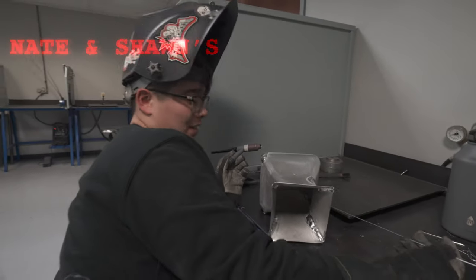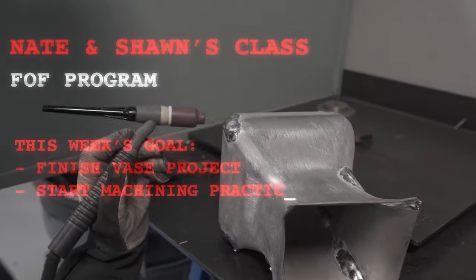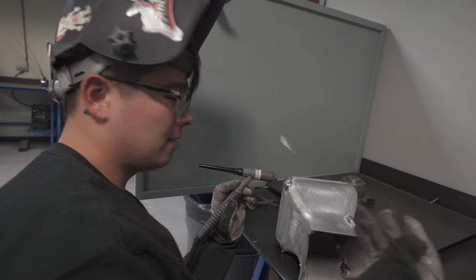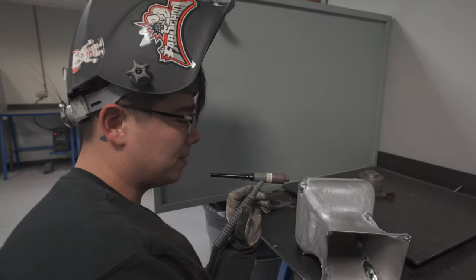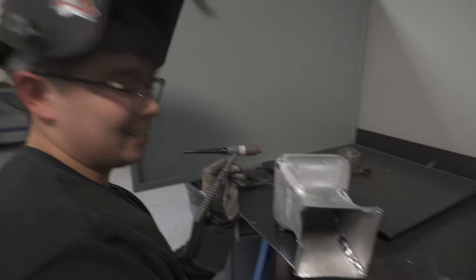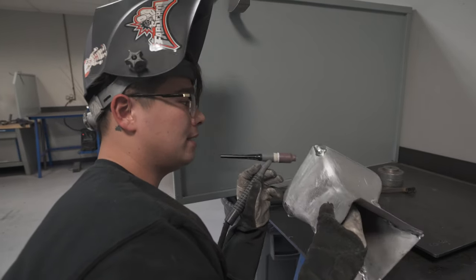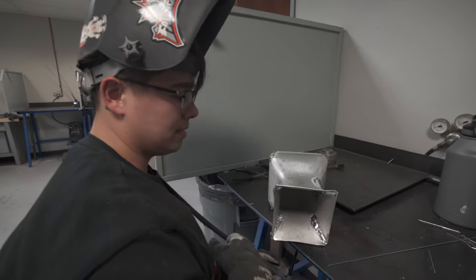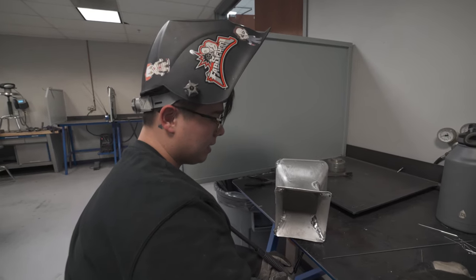What's going on here? Blowing holes — making aluminum Swiss cheese. What is this lump we've got going? Well, there was a huge hole, and all of that is probably about ten rods that it took to fill that hole. You just gotta grind that down and then it'll all look smooth. Because of filling it I do have some low spots, so I've got to go back and fill up those low spots to get it a little bit above, then go back and grind it all down and make it nice and smooth again.